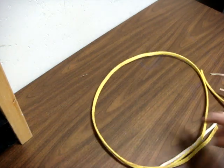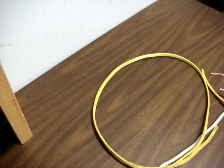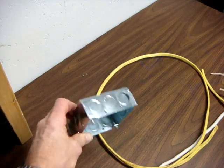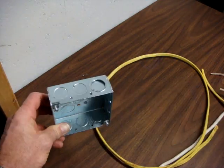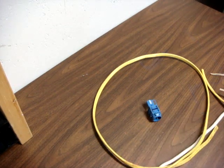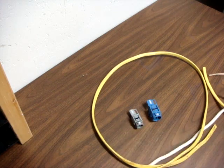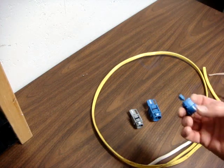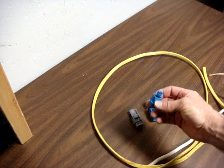You can put this into a plastic box like this if you're going to nail it behind the wall, or if you're going to secure it to a metal box, then you would put a connector in one of these knockouts. You'd pry out the knockout — there are several styles of connectors. This is a three-quarter inch size for larger Romex like range and dryers. This one is for two two-wire cables or one three-wire cable, and this one is good for one two-wire cable: 14-2, 12-2, or 10-2.